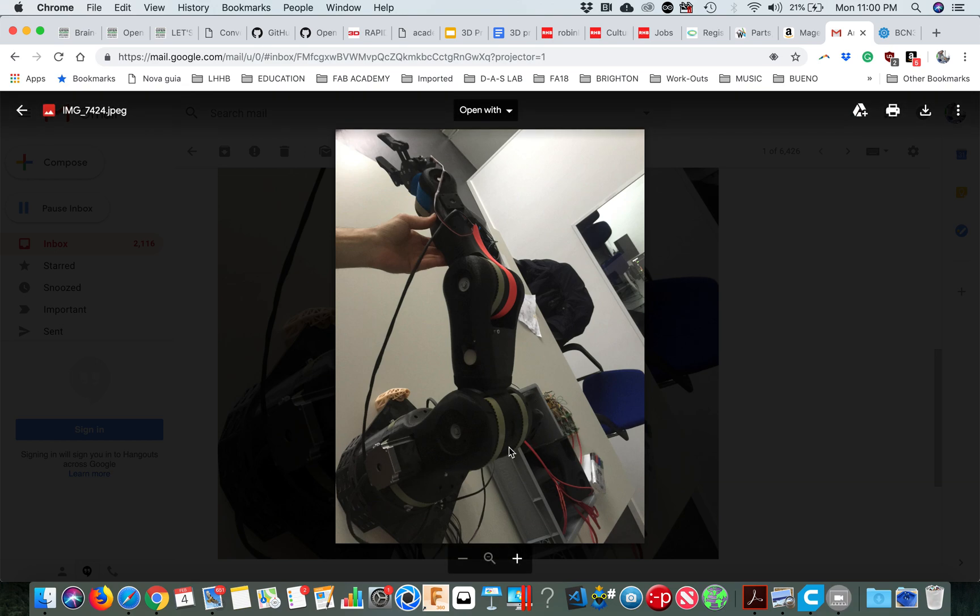Since you have two steppers — one on each side — if I'm not mistaken I see two belts here. Two of these are wired together, so if you see the wiring of these stepper motors, two of them are soldered in series. This is why you're probably using two drivers to drive these two, or only one at max power. If the NEMA 23s are wired to only one driver, I would suggest you buy a bigger one.